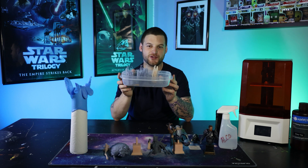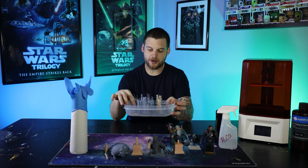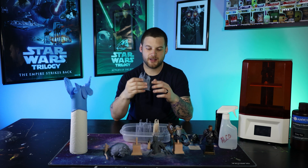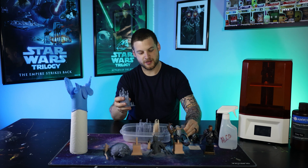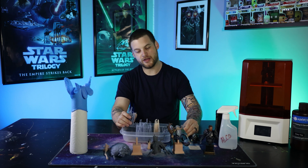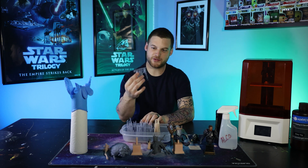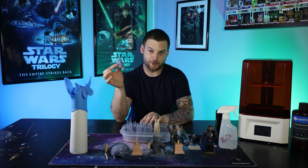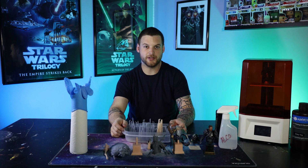The final thing I wish I knew sooner was to save your support structures. If you leave them and cure them, you have a really great tool — you can rip or break a piece off, stick it in the bottom of your print bed, leave it there while you're cleaning, and then rip that piece off perfectly as a handle. Especially pieces with the bottom raft still attached — put it right into the bed, cure it, lift it right off as a handle, and then leave it outside to cure and dispose of it.